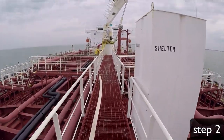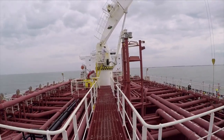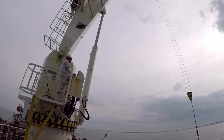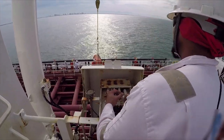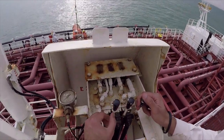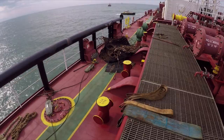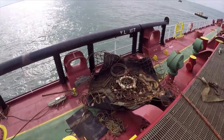We are at the manifold now for step two, which is to connect the cargo hose. The crane has six movements — right, left, up and down on the hook, and up and down on the boom. This is the view which a crane operator gets, and these are the three levers for six movements. Hose handling rail equipment is used, which contains shackles, chains, slings, and wire stoppers.